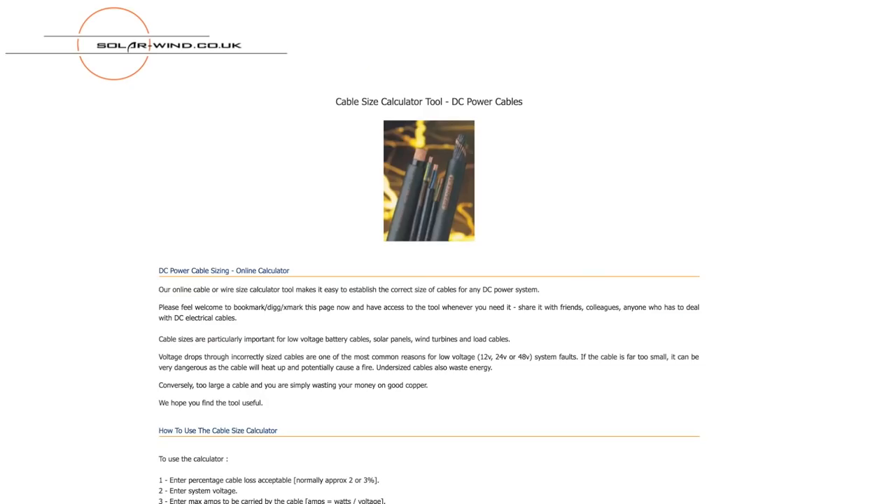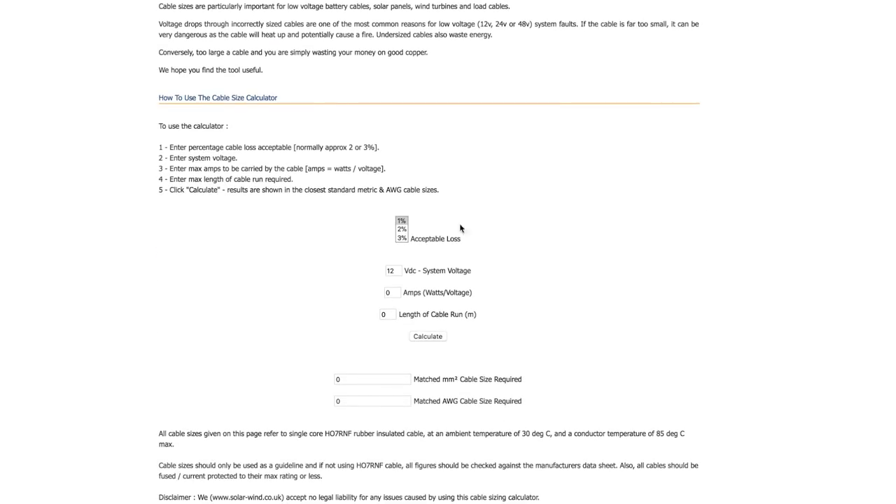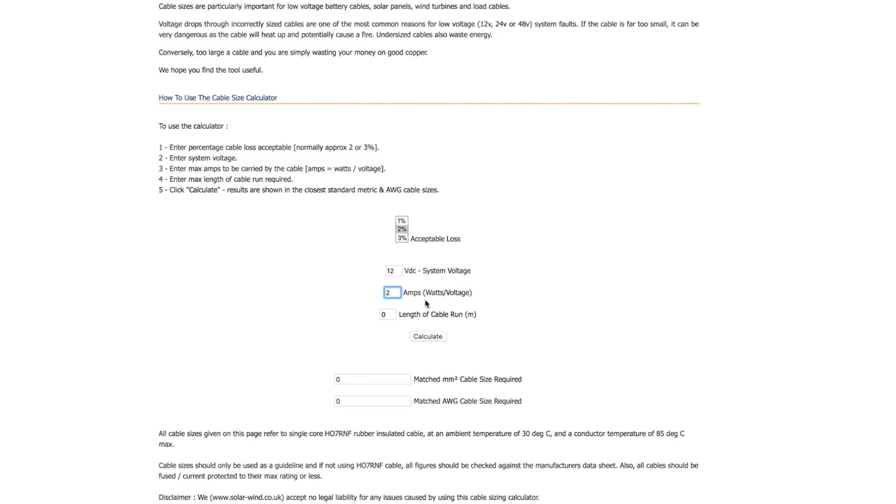In the description below I've linked a calculator that should help you find the correct wire size. If you follow that and scroll down, you'll see a basic online calculator. I would set the voltage drop to 2%, voltage to 12V. As an example: some LED strip lighting — 5 metres of it would run at 2 amps. If the cable length from the battery to the LED strip is about 3 metres, the calculator gives us a cable size of 1.5 millimetres squared, or 17 AWG.